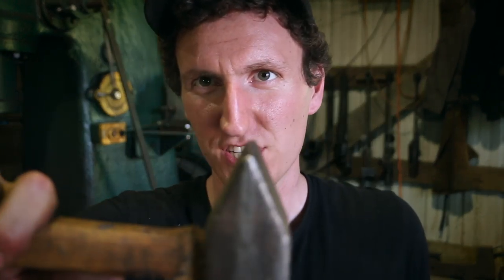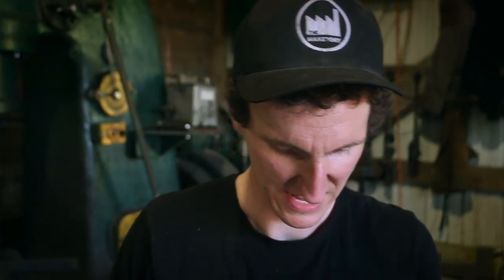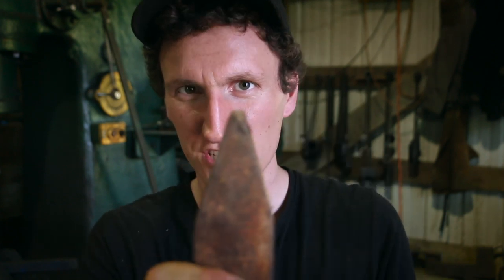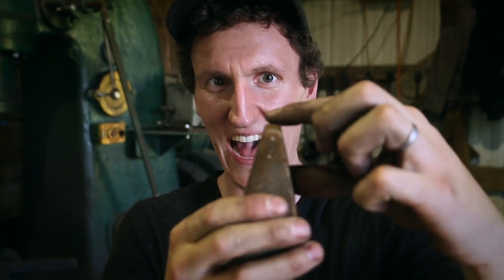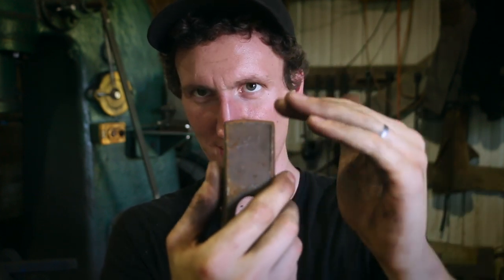Okay, so this is the hammer I was just using. Hopefully you can see that it's pretty abrupt there. This is how you get the hammers when you typically buy them. Hopefully again you can see that, which is just typical, it's completely rounded. And this is my hammer that I like. It's almost flat in this way with relatively sharp corners, and then lightly crowned this way.